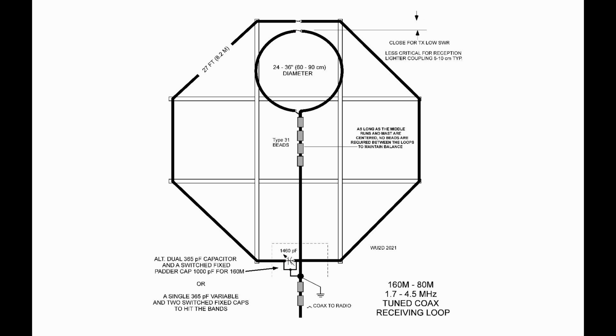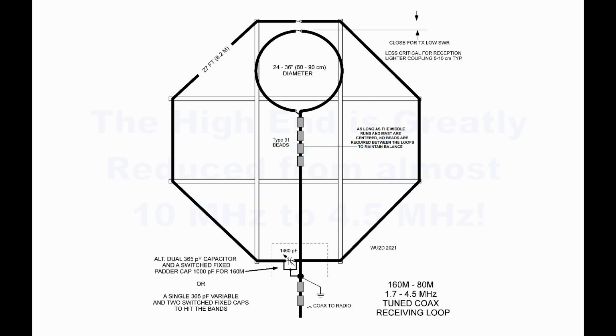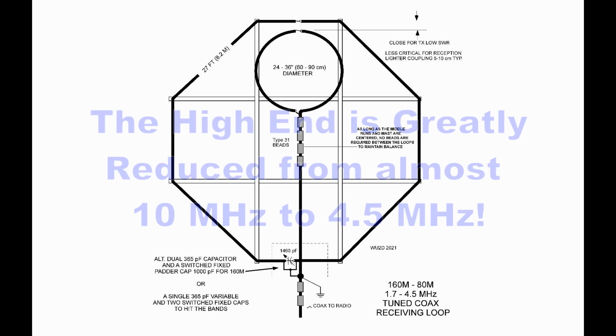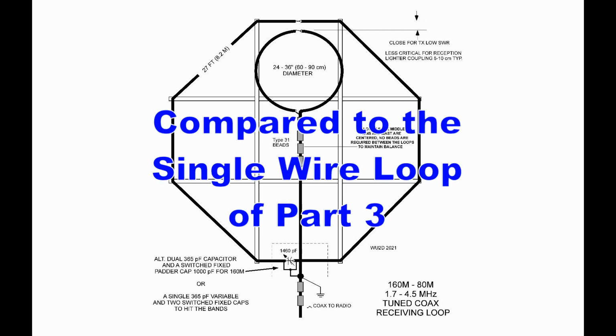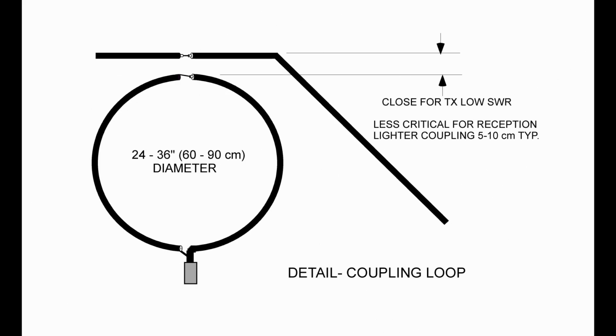Why just below? Well, we have effective capacitance represented by some portion of the RG6 coax. It's approximately 220 picofarads per 100 feet. So there's some portion of that that we're seeing. Also, the minimum capacitance of the gang capacitor, there's some static minimal capacitance there. There's some strays. Certainly there's some effects by the 2 loops together. So we end up with a shortened tuning range of 2 to about 4.7 megahertz, which gives us 80 meters, but we don't quite get down to 160.